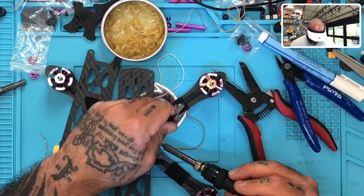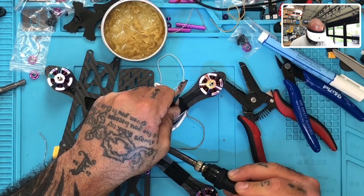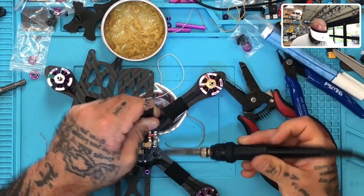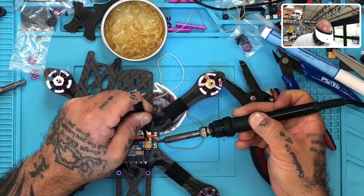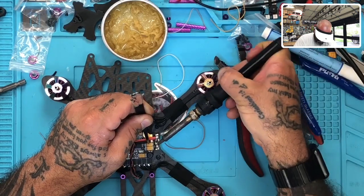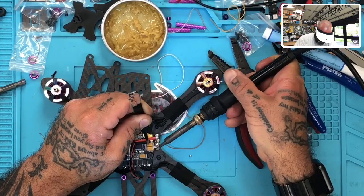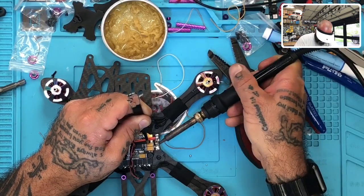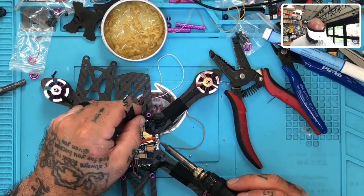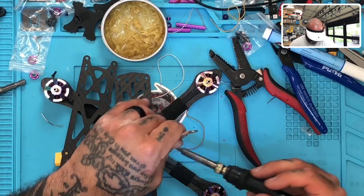We're going to get this cable. We are going to quickly get it to sink into the solder. So let me show you. I'm going to start pulling some of the solder off the board, like this, okay, just kind of grabbing it and scooping it off here. And I want to get down to kind of a nice smooth layer like that. And then I'm going to go ahead and add quite a nice layer right there.